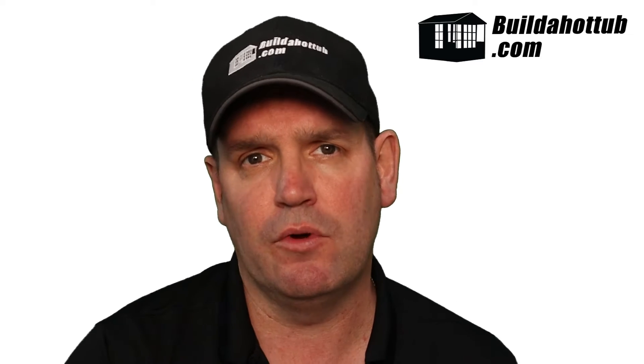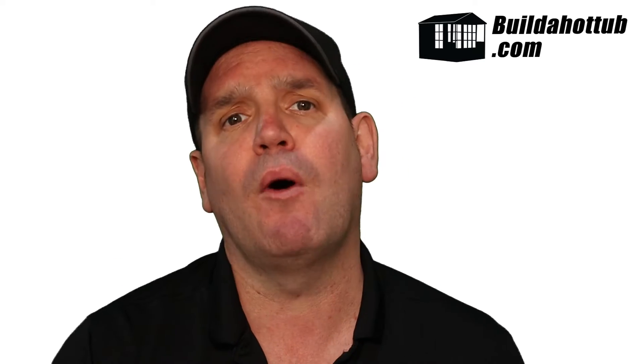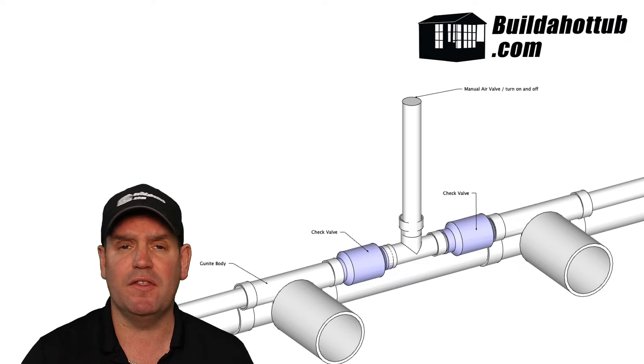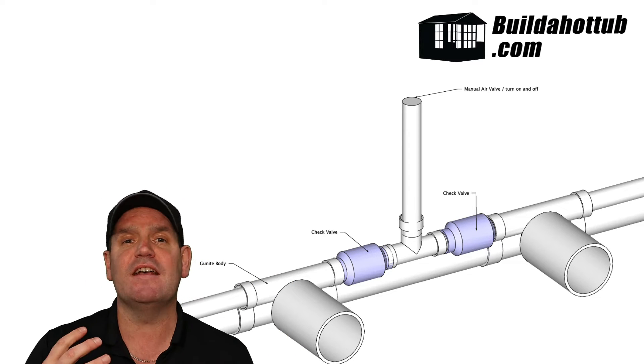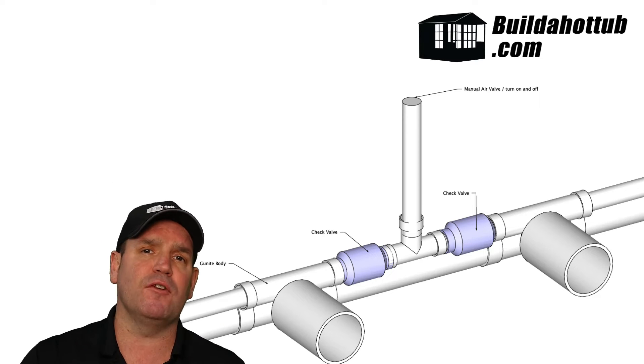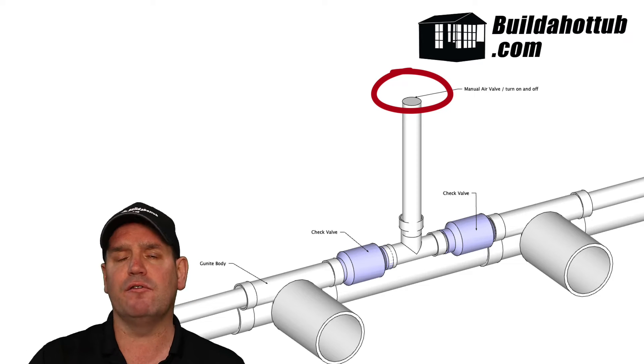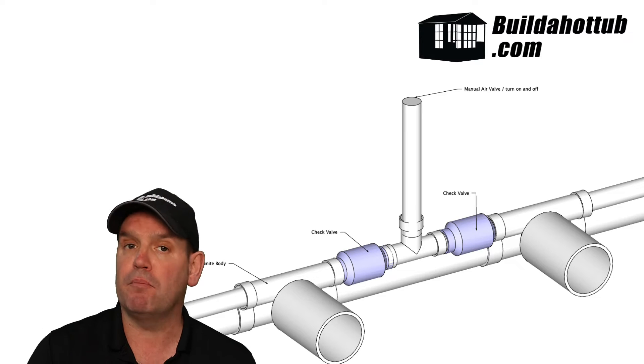So how do we use this setup with venturi? The venturi process is water moving quickly over a hole which then draws air into the hot tub jet. If we're not going to use a blower, what you're going to do is tee into the air lines and take your air line vertically up onto the level edge of the hot tub. On the level edge of the hot tub — and you can see a diagram here behind me — there is going to be an air valve, and this is manually adjusted. When you've got your jet pump running, instead of switching on a blower, you can open the air valve and opening it is going to allow air to be drawn into the system through the process of venturi.